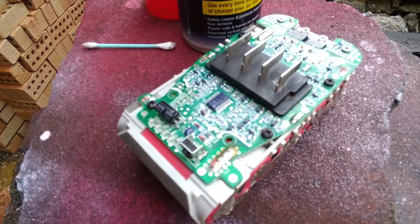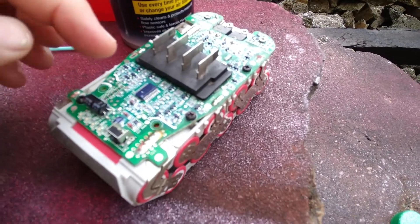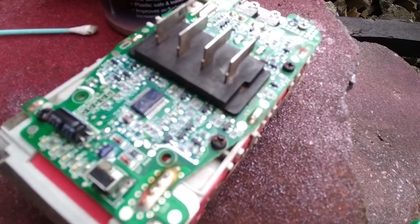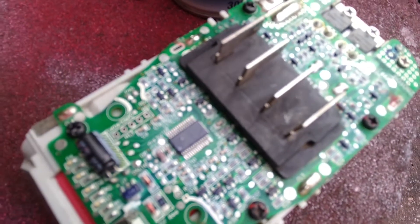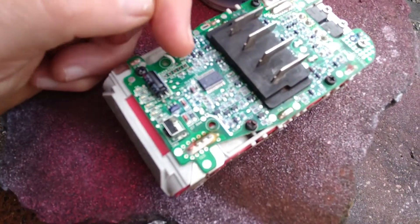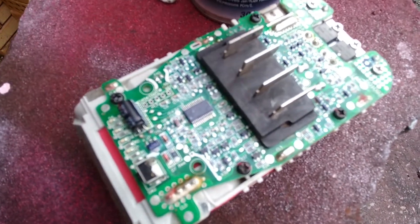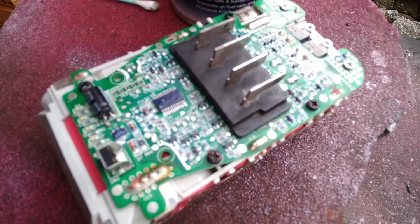In this case I would suggest what had happened is that dust and metallic dust had built up and probably bridged some of the legs on the IC. Because of that it went into a protection mode — went into a safety. So all I had to do was do a reset along those pins: the one closest to the pack is the reset pin, the one in the middle is the ground. Just bridge those out and that gives a reset.